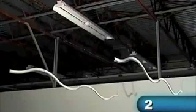Install the next row of main tees following the same steps. In the installation shown here, the first 2 rows of main tees are hung 4 feet apart. Cross tees will be hung between them to support 2 rows of topo panels. Because 2 panels form a complete topo wave, these main tees are hung at the same elevation.